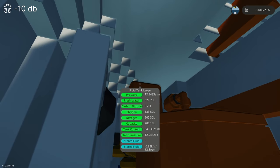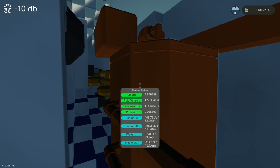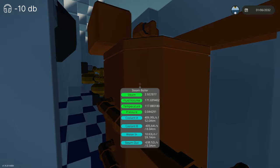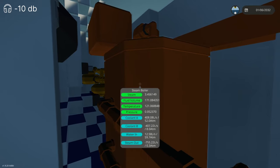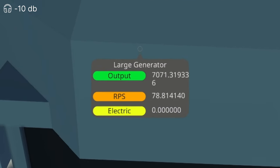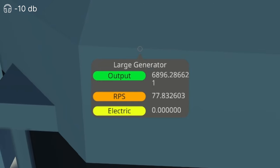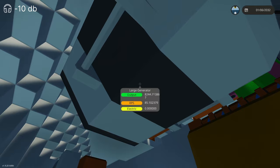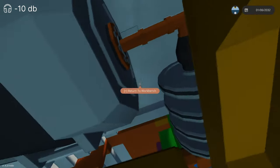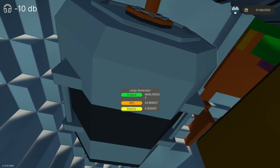The fluid goes down, so this tank goes down a little. Fresh water is going out of this tank, presumably replacing the water being turned into steam. The pistons are going pretty slow — like 0.2 — but that might mean the generator's going pretty quick. It's fluctuating — 5000, 8000. It's definitely going faster than Clifford, though; I think Clifford was only going like 42 RPS. It might be because the clutches are not fully engaged, or it could be the flywheel mass.